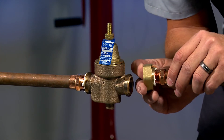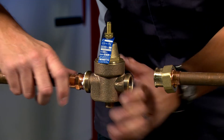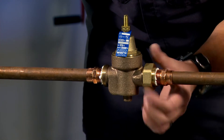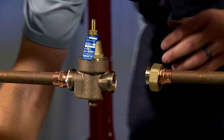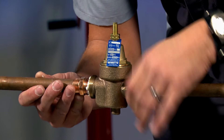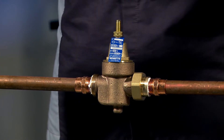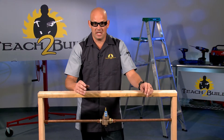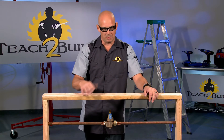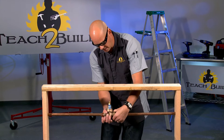We're going to need to solder this fitting on, so we really need that O-ring to get out of the way because it will get damaged by the heat. Once that's on and tight and you've got those ends prepped, solder this joint here and solder this fitting on here as well. Then you should be able to bring the pipes back together. Make sure you don't forget the O-ring — that would leak like crazy. With the nut back in position and the O-ring in place, slide the sides together and get it nice and tight. Once your joints are soldered and you've got this tight, turn on the water and double-check your pressure at a hose spigot. Make sure it's where you want it to be — I like a little higher pressure, so I might adjust it up to the 70 area. Just try and keep it below 80. You marked it, gave a half inch on each side, removed that section, and tightened the pressure regulator in place.